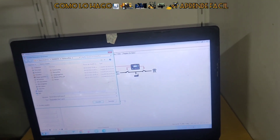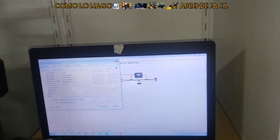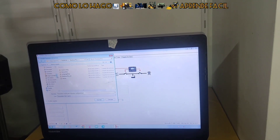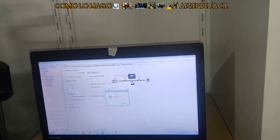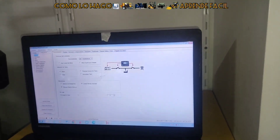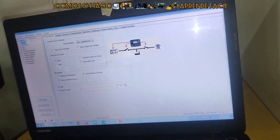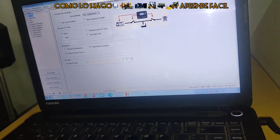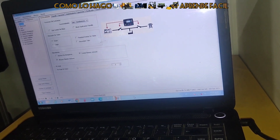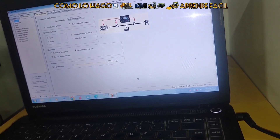To restore a configuration — when you save it on one controller, you simply open it and select 'read from file,' and it will automatically configure. Save — writing OK. So, what you can basically configure here is the module settings. For the AMF function as it comes from the factory — if you were doing a transfer, I already have another video explaining which selection to use: whether it will be for remote start, for ATS only, or for synchronizing another group. It is not necessary to touch that.